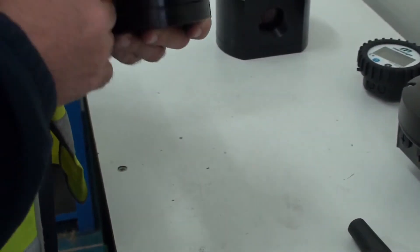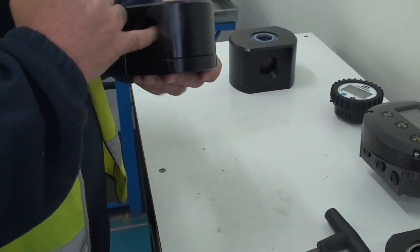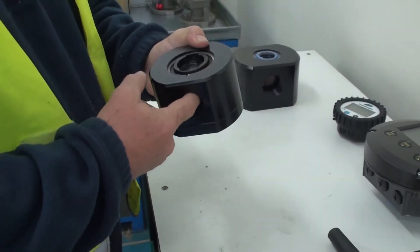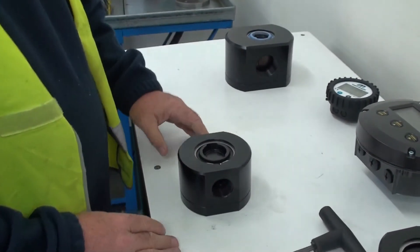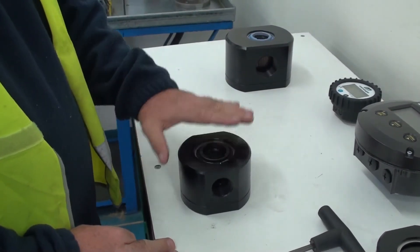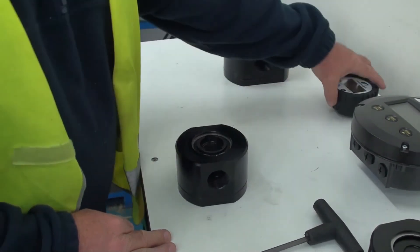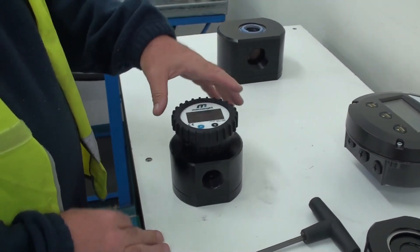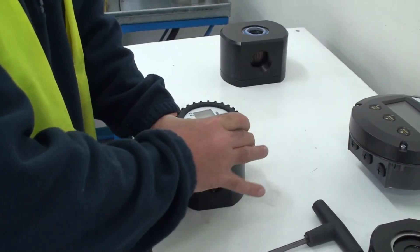That's the eight bolts all tightened down to the set torque as in the instruction manual. The last thing to do is to make sure those rotors turn nice and free — which they do — by putting your finger in the inlet port and rotating them around. Now there are four different options of displays, registers, or proximity sensors that go in them. As with all of them, it's a quarter-turn M-lock system, so it's just a matter of putting your electronics back on.